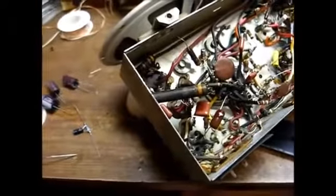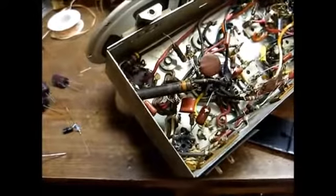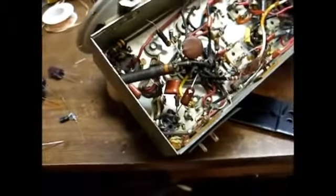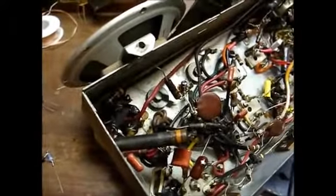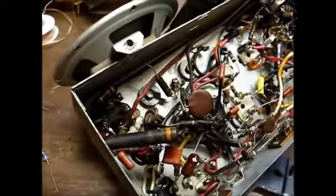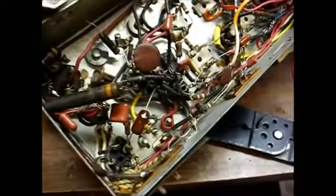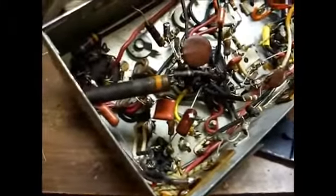I remember a couple of television sets that I fixed that I got lazy and replaced only the bad section of the capacitor, and in both cases, within 2 weeks, the TVs came back with the other section had failed. So we're just going to go ahead and replace this whole thing, and I will analyze the high voltage sections of this capacitor just to see what kind of shape they're currently in.